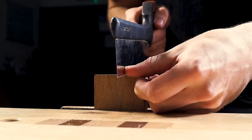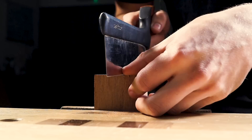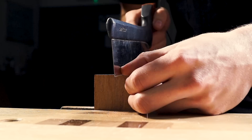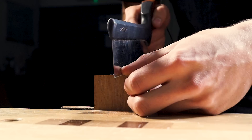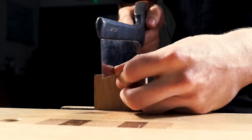By slightly rolling the thumb forwards or backwards, that is what allows you to move the saw side to side. Put the saw down roughly where you want it, then micro-adjust with your thumb by rolling it forwards or backwards. To cut on the right-hand side of the line, just roll it until you get it there and then push. Start with light pressure - pointing your finger down the blade, thumb still there giving it location. Moving your thumb away too early risks rocking the blade, especially as a beginner without that muscle memory.